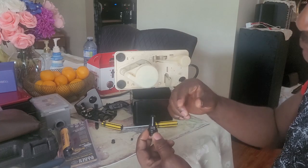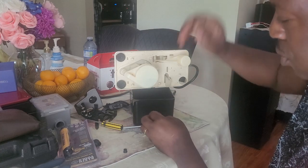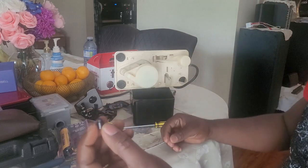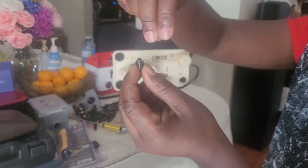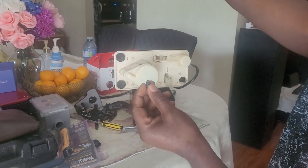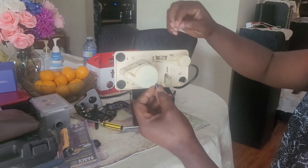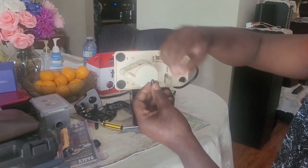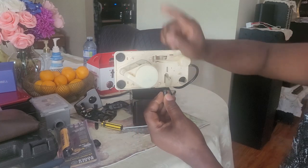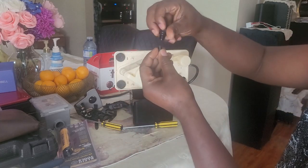So in that case, after the pump pumps most of the water out, this ball is supposed to come and sit on top here, right? So with the water pressure, it blocks the water from coming back from the tubes. I'll probably have to go down and show you, because there is a tube here that is connected to outside, that the pump will pump the water through the check valve, because this is sitting here at the bottom.